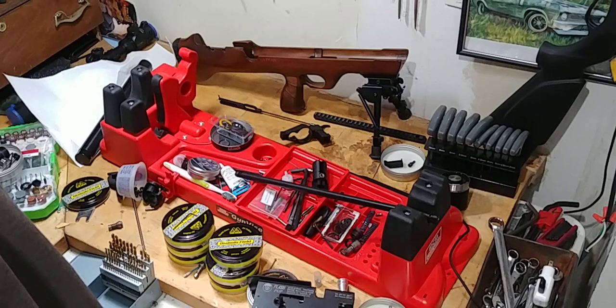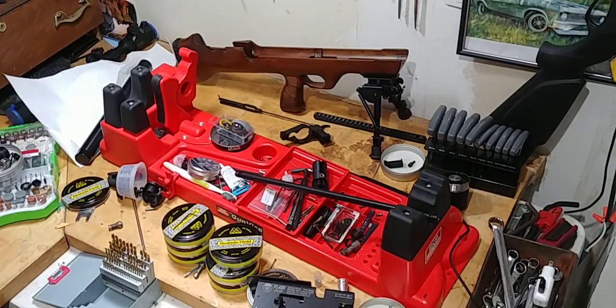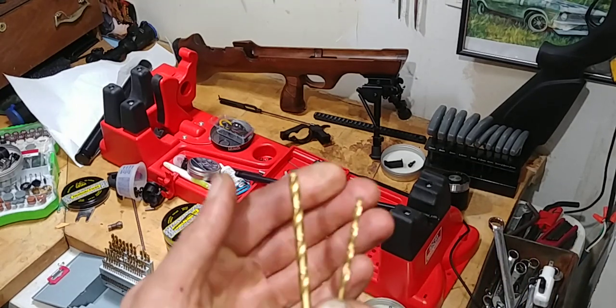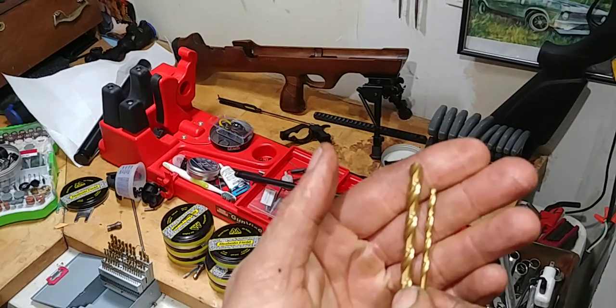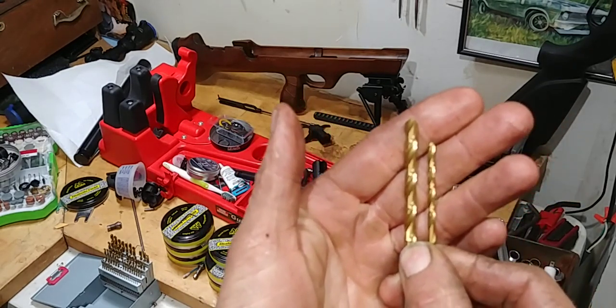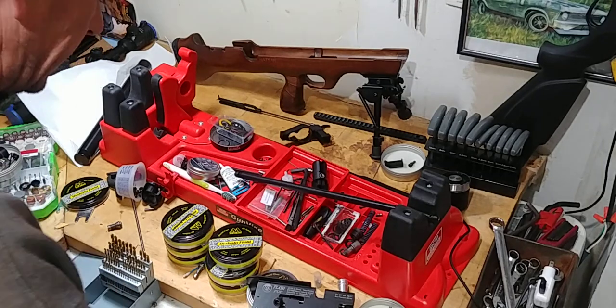Okay, thanks for watching, and like I said, 116 thousandths and 195 thousandths. There's a big airflow difference in there. So definitely the receiver is the weak link on this for pushing air through, and that's what I want to do.